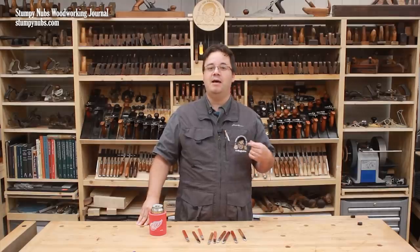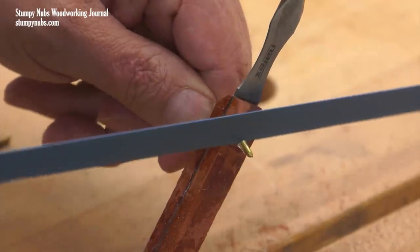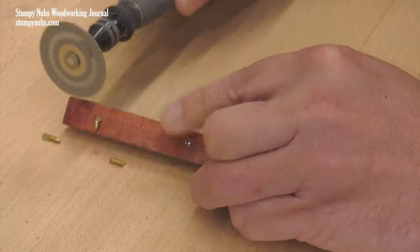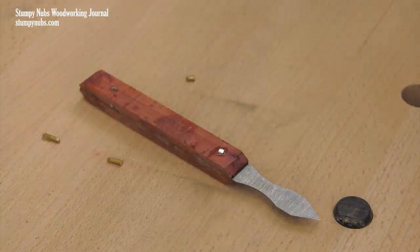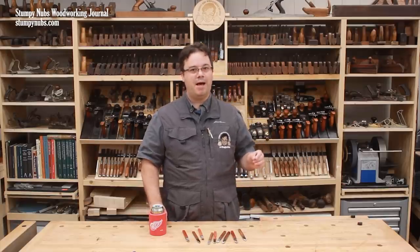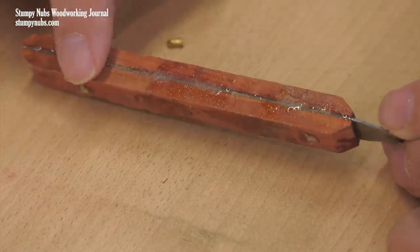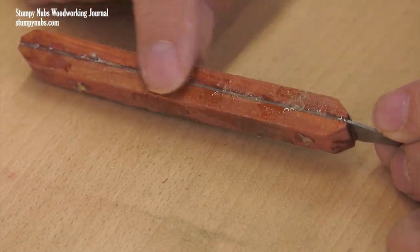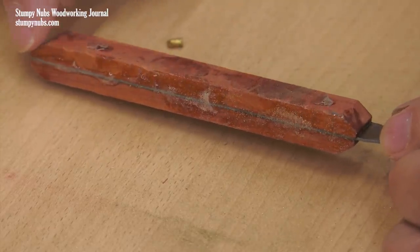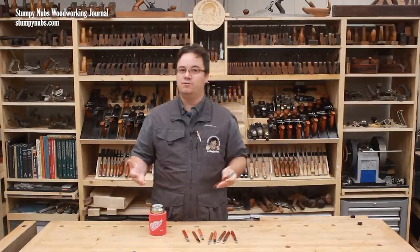The fun starts tomorrow — and by fun, I mean the sanding. But first, you must trim the brass pins. A hacksaw will work; a cutting wheel on a Dremel will work even better. Whatever you use, try not to mar up the wood too much or that'll mean more sanding. Here's the thing about sanding these: epoxy sands easily, so does wood, but what remains of the brass pins and especially any steel blade that may be protruding past the scales along the edge of the knife can wear out your sandpaper in a hurry. So you may want to try some other options first.